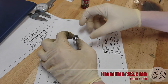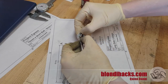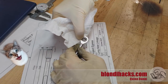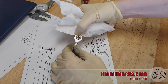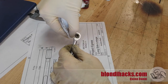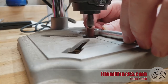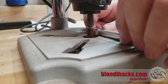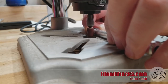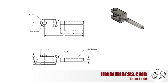It won't look quite as nice as the machined top does, but it'll give it a little bit of an artisan feel. Now we're ready to glue the bearing in place. I'm very carefully putting glue in just a couple of spots because there are oil holes on the bearing and we really don't want to get Loctite into those. I ease that guy in there and wipe away the excess, being very careful not to get Loctite in the swivel of the bearing itself. Loctite 603 is amazing stuff — once it cures you will never ever be able to get that bearing out. To clean up my file work I'm using my Dremel drill press attachment as an improvised spindle sander, and this worked out really really well.